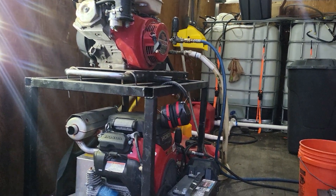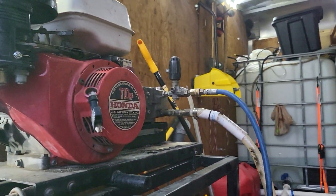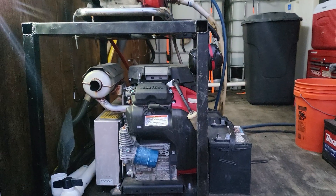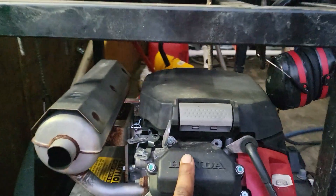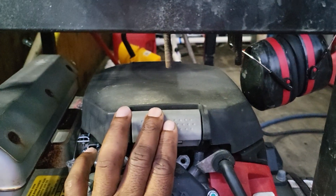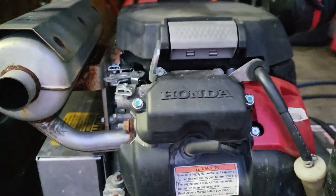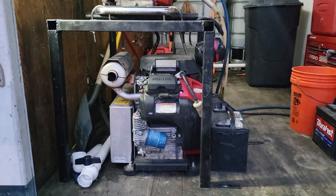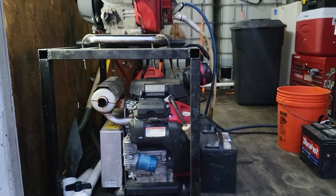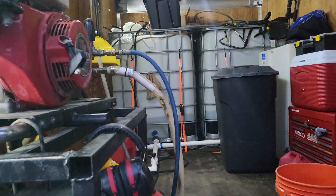We definitely have to make sure we have enough water. If you've ever thought about stacking your machine and wondered if it'll pull water — it will. I wanted to make sure that with the engine stacked I could still service my GX690, like changing the oil filter or doing easy maintenance. The clearance is about 23 inches from there to there, and adding another 7 or 8 inches to where the hose is — you're pulling water about 31 inches in the air.